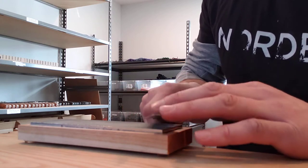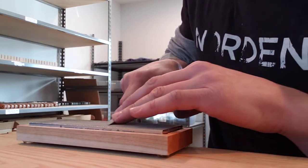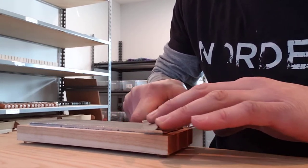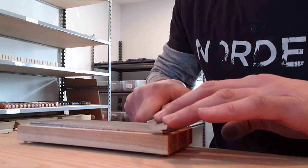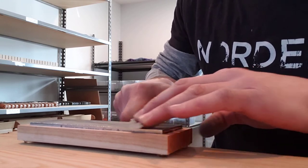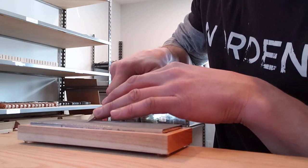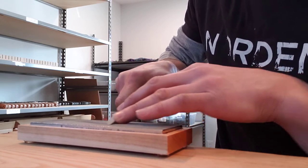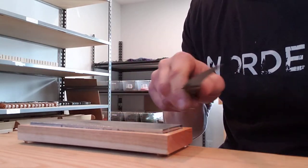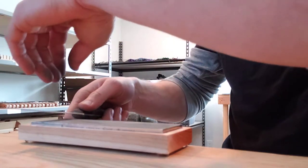You're grinding away steel here — that's what we're doing. You can see that I'm keeping pretty firm pressure, keeping the angle, and keeping pressure down with the other hand. I am grinding away steel right now — that's what I want. I'm trying to create that burr to get that edge back up, and I can feel it. The best way to describe when you need to flip sides is when it gets easier — when it feels like it's sliding across a lot easier, that means you've ground away most of the material, then you switch sides.